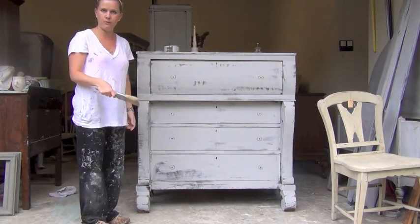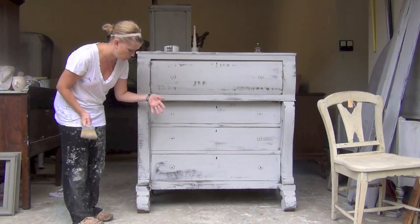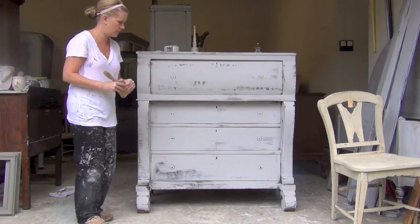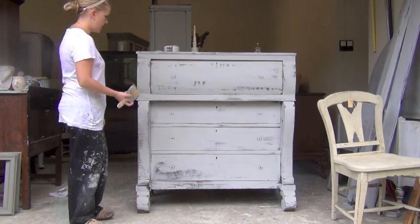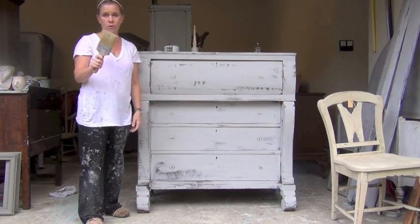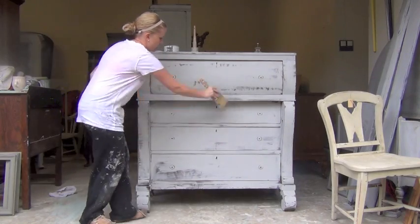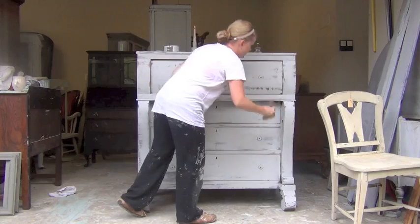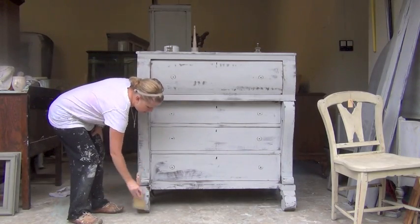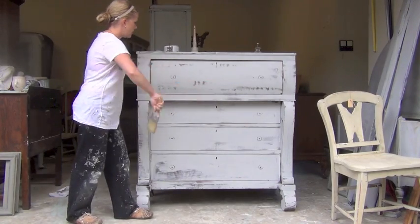You can see this is our piece that we're working on and I've sanded it. I've gone around and really sanded all the edges, all the places that are going to have natural worn surfaces, as if it was truly getting rubbed and antiqued. So every surface, every door, just really rubbed down. Obviously you're going to have a lot of dust, so I have a big soft brush — the biggest one I could find — and you just go around and dust off all that sanding dust. Make sure it's clean, because when you do the wax, the wax is sticky and you don't want little dust particles in your wax because you will see them.